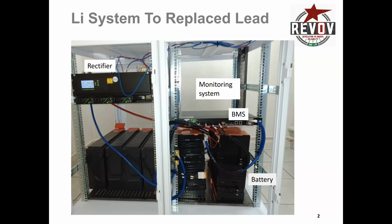Now, the cable packs do come with these cables here, which are the 25 millimeter cables. They do come with nicely attached lugs and a little label on each of them, which will say B minus and P minus and stuff like that. So it will indicate to you exactly where to put the lug and connect it up. On the BMS, the terminal on the right-hand side, as you're viewing it, is always marked as B minus, so battery negative. You would connect from the battery 2 negative line across into that terminal.